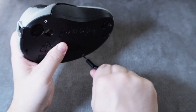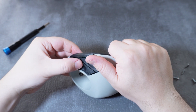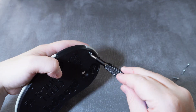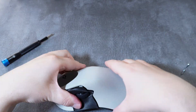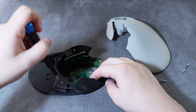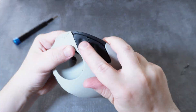When you've got all that done and all is well, screw in the bottom four screws, then check that all the buttons are clicking down correctly. You might find that the right buttons in particular either stick or don't push down properly — if that's the case, unscrew the bottom screws, take the top cover off, and reposition the right mouse buttons. You'll probably need to adjust the screw a little bit to change the position. I found that a slightly looser screw with a little bit of play in the buttons is what worked for me.